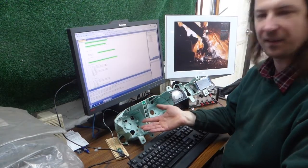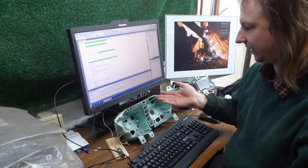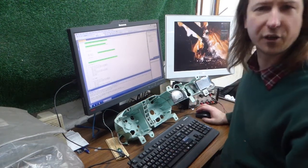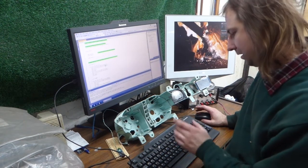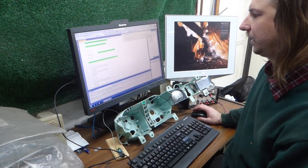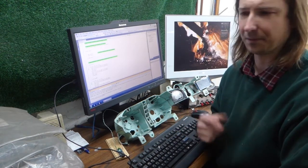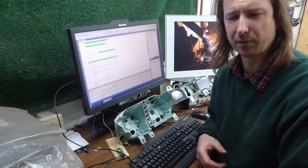Well, I just whipped up a very simple test rig using an Arduino Nano, which just blinks each side 3 times and then moves to the next side. So, seems to work. Of course, these being RGB LEDs, they can be any color I want. So let's say I wanted blue signals. Just a simple code change and upload a new program. Now my signals are blue. Of course, I think the turn signal lens in the dash is green, so unless I replace that, I'm stuck with green regardless. Who the hell would want blue turn signals anyway?